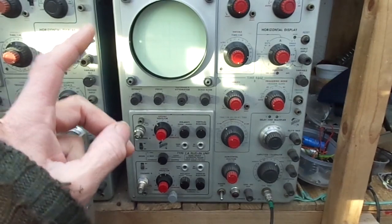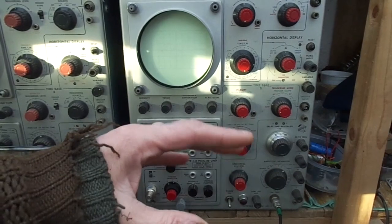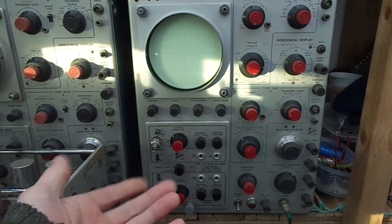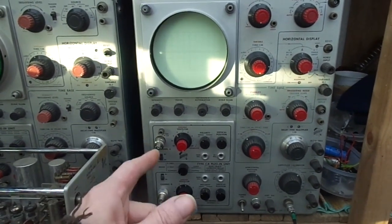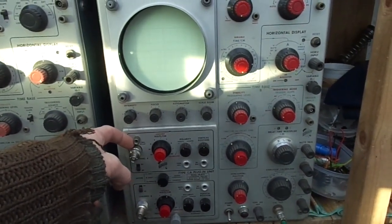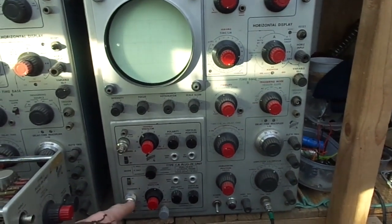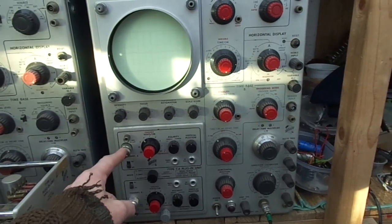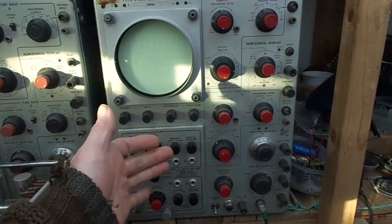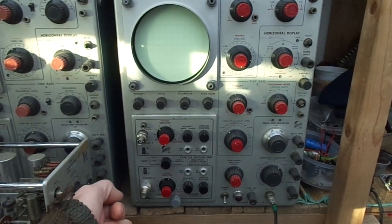Anyway, more progress on this. Found a couple of wires off yesterday when we had all those switches bouncing about. Some of the connections became unconnected. Fixed those. Another issue I found was signal in here, signal just behind there, not present. I'd cleaned one of the sockets, the inside pin, not the other. That was the reason. We said this was made in 1965, do the maths, 60 years of gunk basically, stopping the signal getting through.